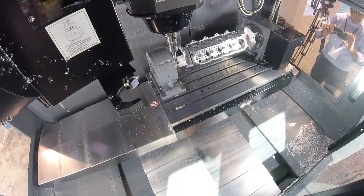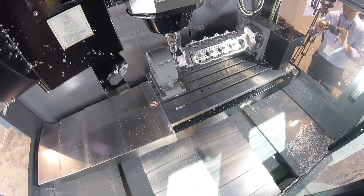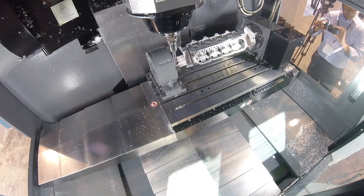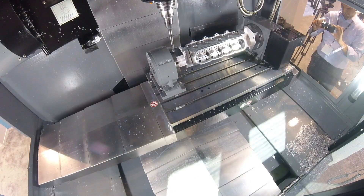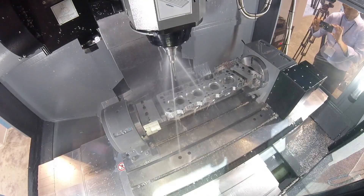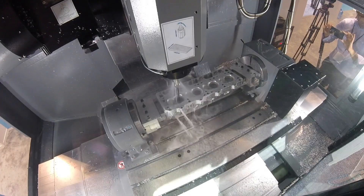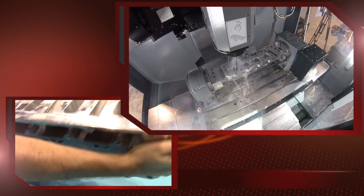One reason that we chose this machine was a 40-tool tool changer with a CAT 40 tool system. There's a 10,000 line look ahead, and with the 10,000 line look ahead it has very good 3D motion. We use Mastercam to program that in their Port Expert and it works very well. The post comes out great.